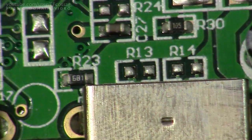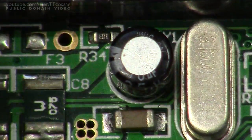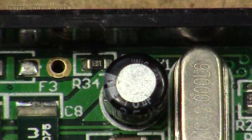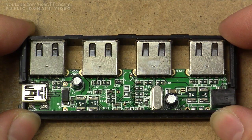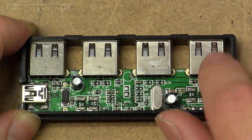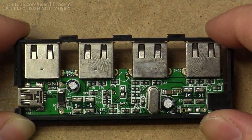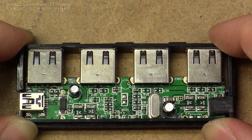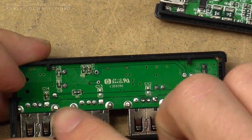It's good to have capacitance for when you hook those pesky high-current devices in. Curiously though, when we look at the old one, one of the caps seems to just be snaking its way in underneath the chip somewhere, and the other one is just straight across the 5V input it seems. So the old one actually doesn't seem to have any real capacitance to couple through the ports. I beeped it out and neither of these two caps are straight across the USB ports. This one's straight across the external 5V supply, which is more or less straight across the USB ports but it's through the polyfuses, and not really too strongly connected. Since this USB hub has been working so absolutely great for so long, I really can't fault it, but I'm a bit surprised — I would have been more prepared to see a layout like the new one where they've just got the big caps straight across the ports.